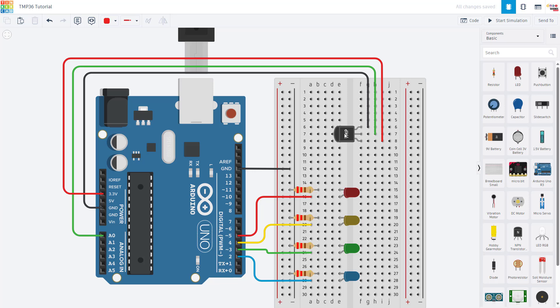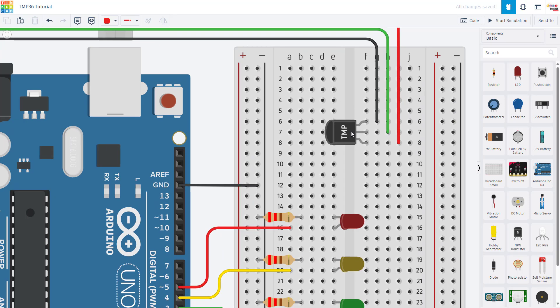In this video, we are going to focus on the wiring for the sensor. The sensor has three pins — if the side with the writing is facing you, those are pins one, two, and three from left to right, though with the sensor rotated 90 degrees in the breadboard, that goes one, two, three from top to bottom. Remember that each hole in a half-row of the breadboard is electrically connected to the others. So when you place the sensor in the breadboard, each pin needs to be in its own separate row — do not short all three pins together in the same row or the sensor will not work.